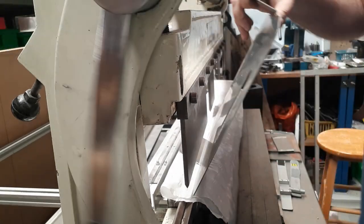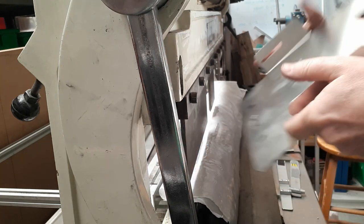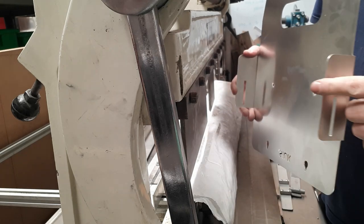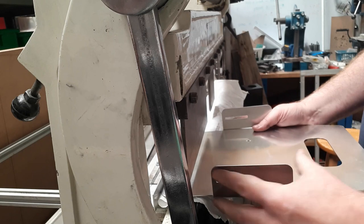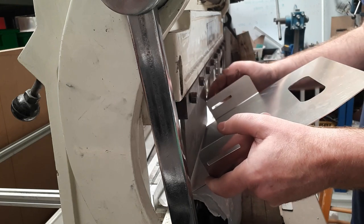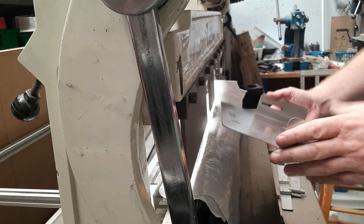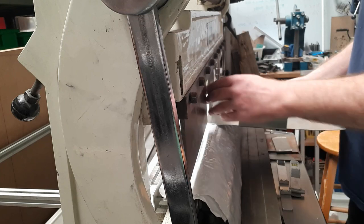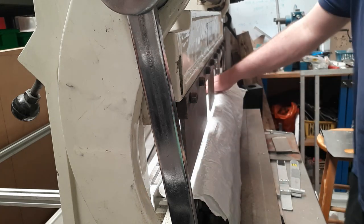Okay, that's a few done. Once you get into a rhythm it's quite good. Now we've got the problem of bending up these sides, and we've got to watch that any blade in the frame allows the folded-up parts to pass. When I insert this — and if I haven't set the fence right — it's going to bend up and if the blade was too wide it would foul on the frame. This particular blade is bang on, so as long as I line up the part correctly this one will be fine. These are the little things you've got to think about.